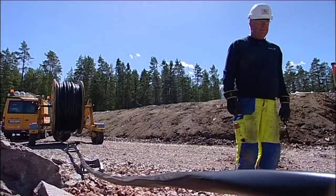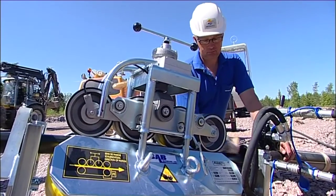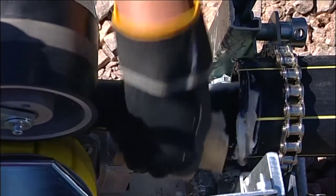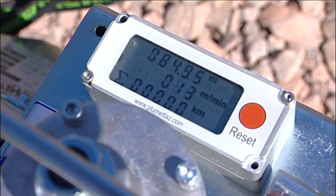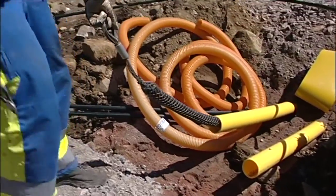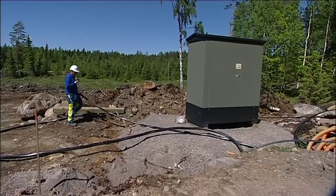The method of winching and propelling the cable through the pipe works effectively on very long stretches. The equipment that feeds the cable into the pipes is small and light but powerful. Here a cable is being propelled into a pipe length of only 120 metres. A winch is not required for this, but with a winch and double feed units the system can cope with lengths of up to one kilometre.